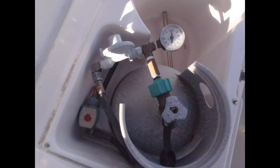Use leak detection fluid or a solution of dishwashing soap and water to find the leaks. You'll typically find them at fittings and connections, although they can occur anywhere in the system due to chafe or physical damage to supply lines or other system components. Do not use solutions containing ammonia, which can attack brass fittings. And unless you want top billing at the Darwin Awards website, never use a flame to check for leaks.